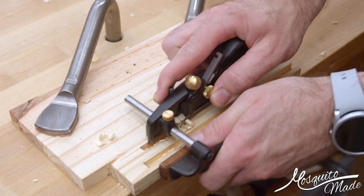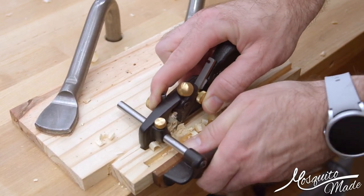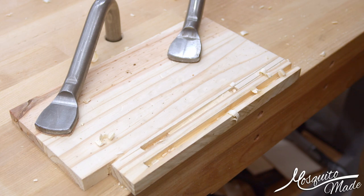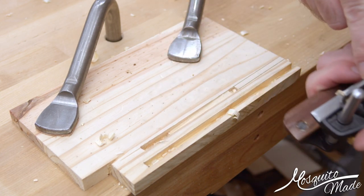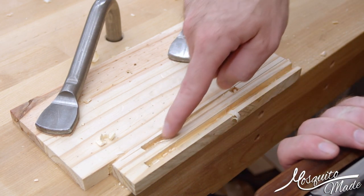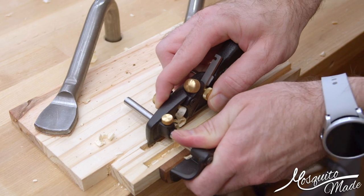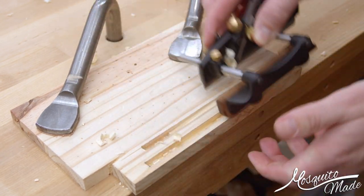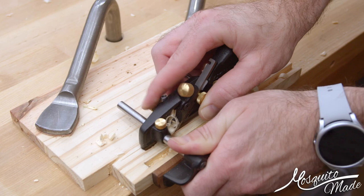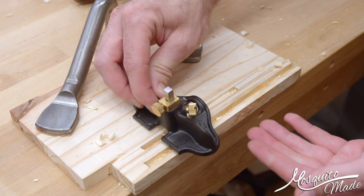You can just have that spot for the front part of the skate, and then basically start it out the way you had it before. The slight caveat here is that since the rear is not done, I have somewhere to go, so I'm kind of cutting downhill — cutting down into that front piece. You can see there's a little ramp there, so I'm not going to be able to get all the way down to my depth stop because of that ramp. You can keep going until you stop at that end, but then you can only cut so far, and once you do, you need to figure something else out. You could come in with a small router plane and a quarter-inch iron and just go at it with that.